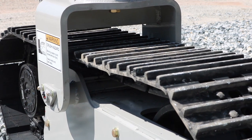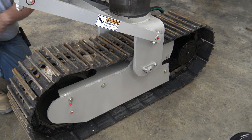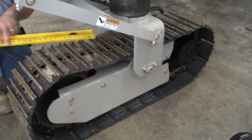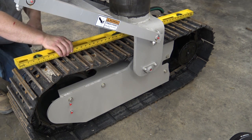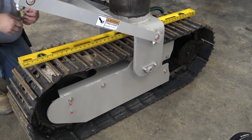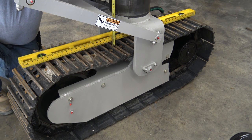A good rule of thumb: it is better to be loose than too tight. The easiest way to check the track chain tension is with a 4-foot level and a tape measure. Lay the level across the top of the track after driving forward. Measure the amount of sag as close to the center as possible. This will be the distance from the top of the track pad to the bottom of the level.